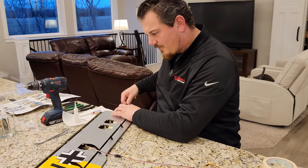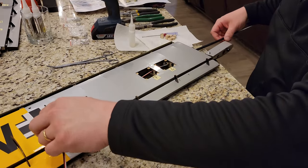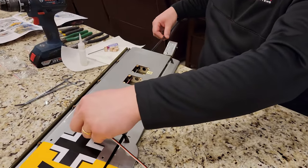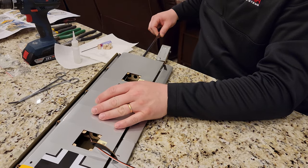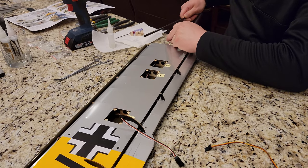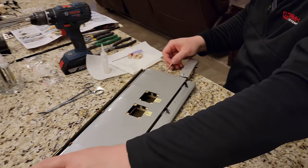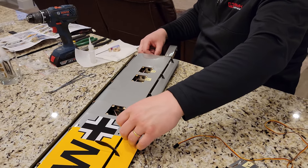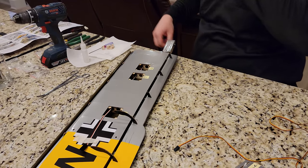Ooh, wow. Ooh, that was good. Ooh, slipped right through. Wowzer. Woo! Wow. Boy, that was a little easier than I thought it was going to be. So what I'm going to do is feed this through, and you're like, well, but Brian, you got two extension cords. How many extension cords do you need? Well, I need two. The reason I'm doing two is because once I get two through, then I can just tape the other ones on and kind of feed it back through. Obviously you don't want to pull real hard, because these are joined together by a connector, you're going to at some point need to stop it from coming through. Okay. So that's stopped from coming through now.